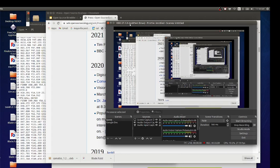6 by 12 gets compressed to 4. You start with about 8 inches, so the chamber is like 8 inches deep. It compresses to 4. And at that point, you've got blocks that, we took some measurements, are like 700 PSI strong. Those are plain, unstabilized blocks. We measured that long ago, like 2009 or 10. That's the kind of numbers we get.